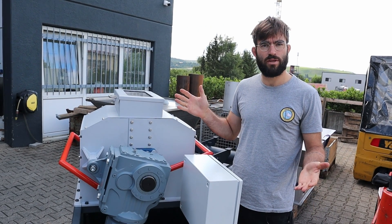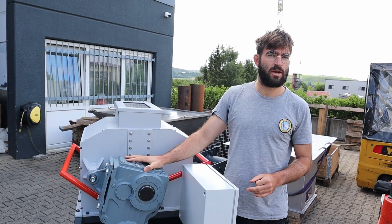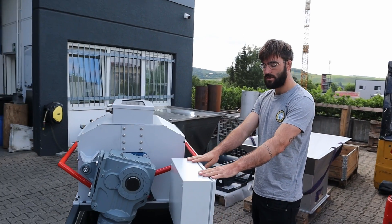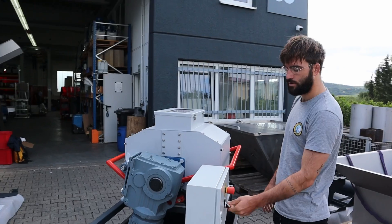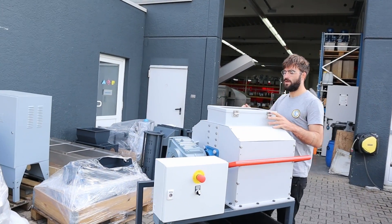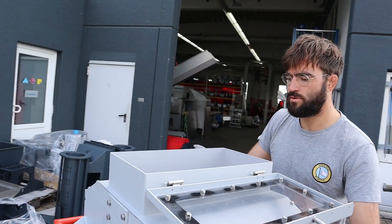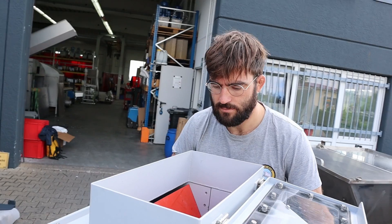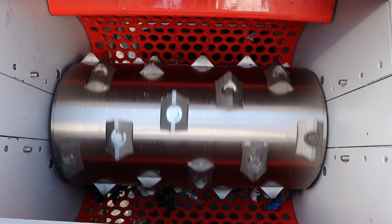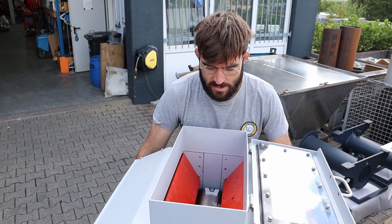To present this shredder briefly: we have here a three kilowatt motor that is turning at 55 rotations per minute, and we have a very standard electric box with two directions. The shredding is happening here — it's a single-axis shredding with two sieves that you come pressing on it. You pour the plastic in, the plastic goes on the side, the motor is turning, and you press the plastic against the rotor.